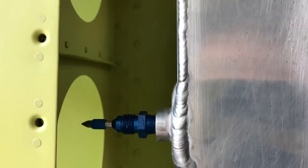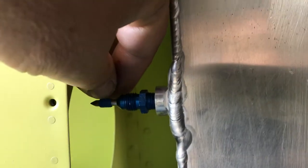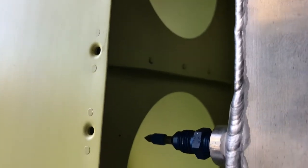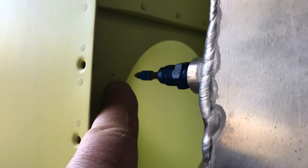But I needed to mark the location of that one, this one, and this one. So this is how I did the little guys — you can see right here I took a piece of drill rod. I've got different sizes in my shop, and I made a tool that will slide in and out of the fitting. I put a point on it, ran that point up inside there, and marked the point.